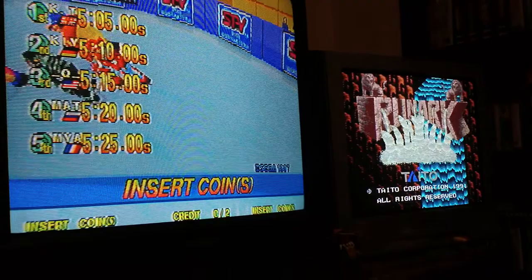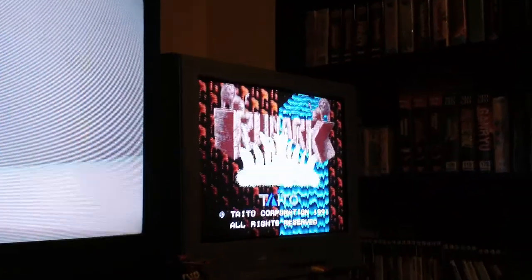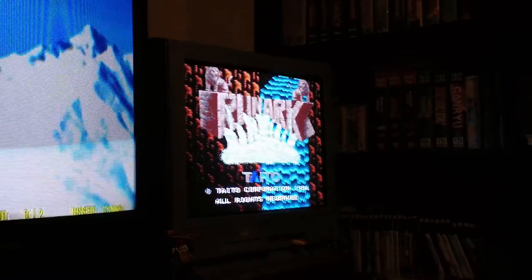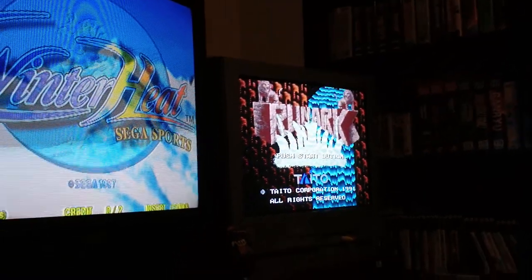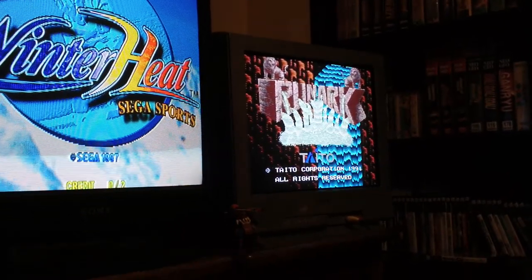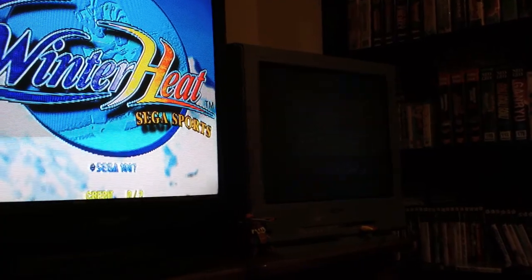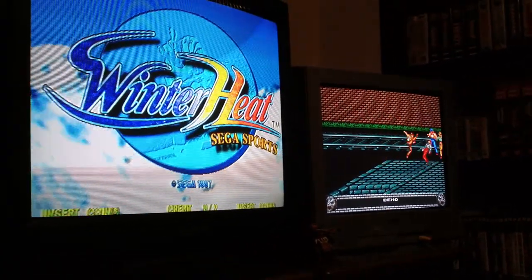With these two I was having a little bit of a problem with that. But with the three I have over here I've never had that issue because there is a sufficient amount of distance between them. Mainly I think the culprit here is that this CRT is one of those energy-efficient CRTs, which were configured to operate at much lower anode voltages. So the electron beam travels more slowly and it makes them a whole lot more susceptible to EMI.